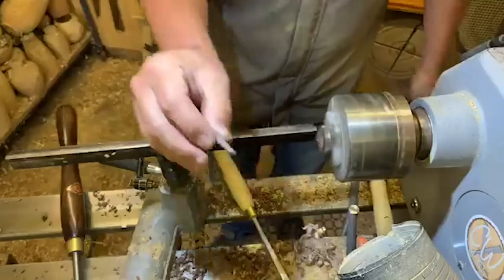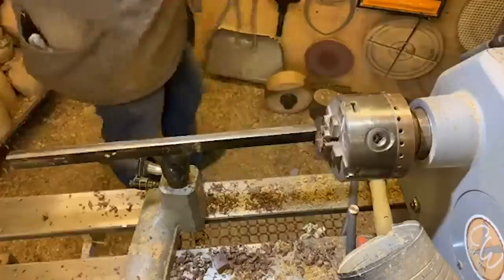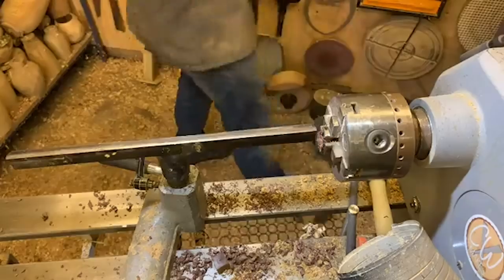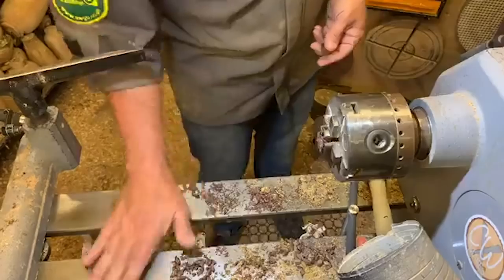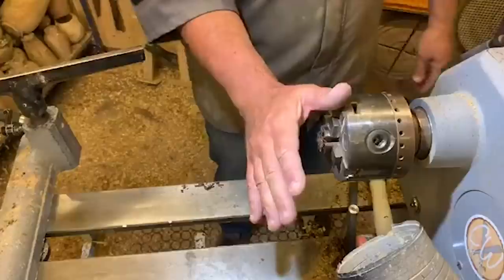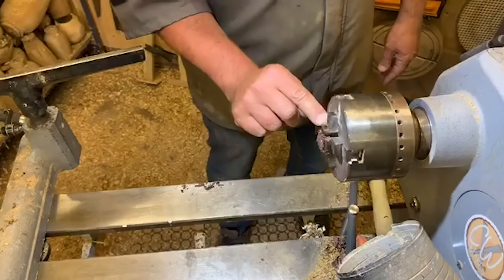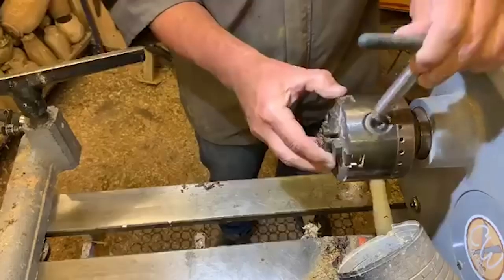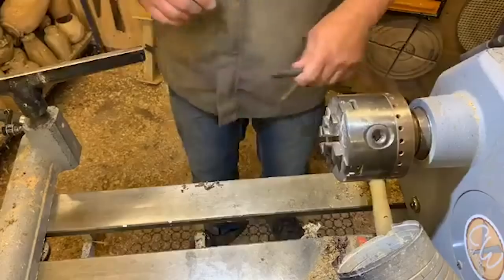Part that one off, place the stem in. However, remember the pin jaws - I would always say if you don't have pin jaws and you're trying to decide which ones to go for, go for the pin jaws. The pin jaws are going to be far safer to your hands. The older style are like knuckle dusters and when you catch a knuckle on one of those corners it really hurts. Go for the pin jaws - we've got all those modern equivalents now, far better for your fingers.